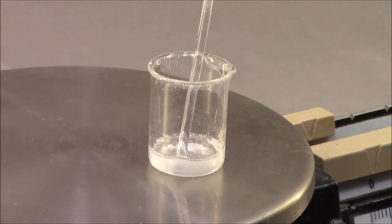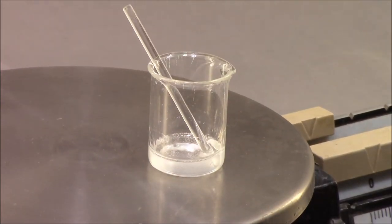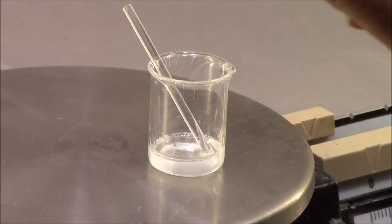So the idea is, with Hxtal, I use it to repair non-porous objects. Pretty much exclusively glass and the finest porcelain, which looks like glass. It is very, very strong, and it can wick into cracks that you couldn't get glue into. In other words, you might have a crack in a vase, and you can't pull it apart to let glue get in there. So I heat it up in a hot box to 150 degrees, and I take it out and I put a few drops of this along the crack. Let it sit for a couple of minutes, and you'll see that it will get sucked right down into that crack.